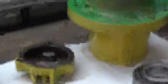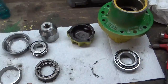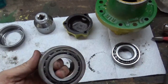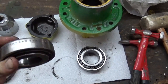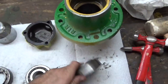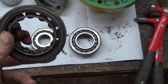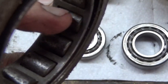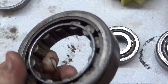That's it on how to take apart a set of hubs on a John Deere tractor — at least one hub. Now you know what you're looking for in your bearings: scores, races, burrs, anything. You know what'll work and what won't. I would advise that anything any looser than this — get new ones. But if this is all you got, it would work for a long time. They're not horrible. Something like this with real bad pits out of a bearing — no way, do not use this, throw that bearing away. But if they look like the ones we have here, still usable. New ones would make it even better, but it's really up to you.